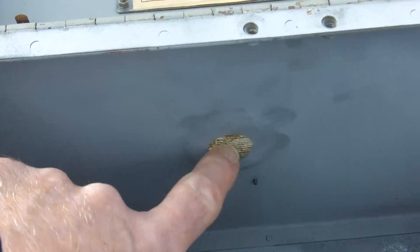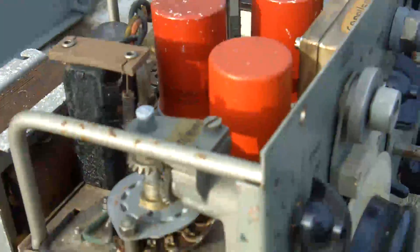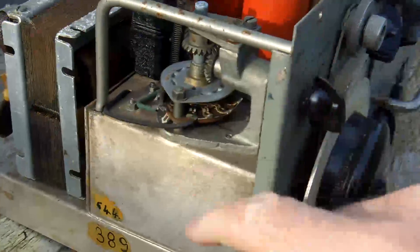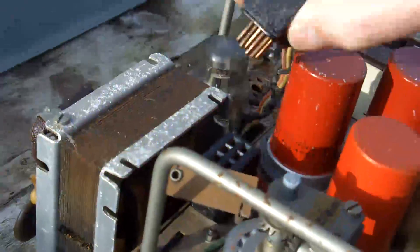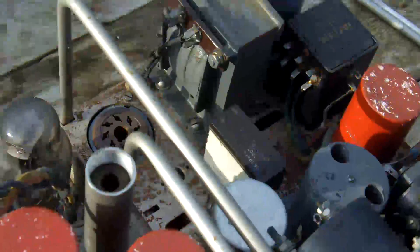I've got the unit out of the box — I had to unscrew it. There's a nice rotary switch that I guess goes down through into the tuning mechanism, with a 45-degree bevel gear there. There's a little Jones plug with a spring on the top to keep the two together. There's a crystal here — I'll get a close-up — and the date on it is December 1943.